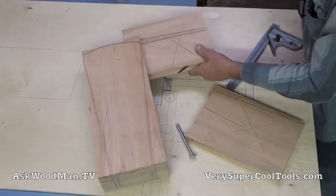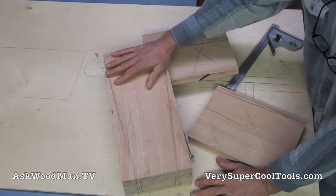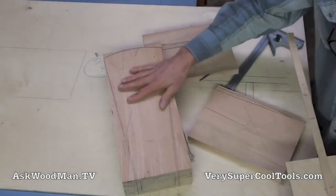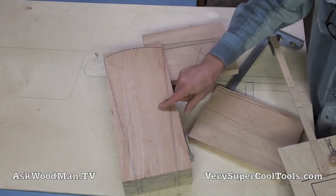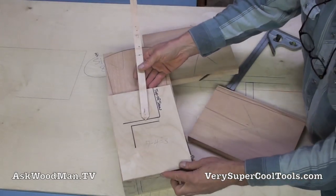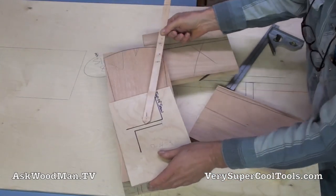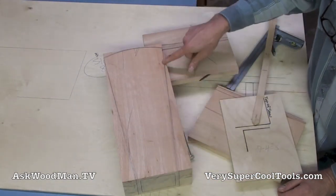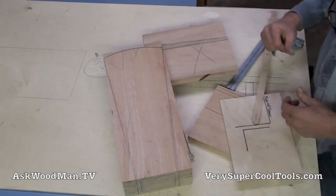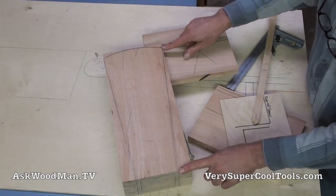Let me also discuss how I did this while I've got it right here. I drew my keystone — the keystone ended up being just ever so slightly different than the drawing. I didn't want to put a nail in the face of my piece. On the four outside pieces in this batch of beech, there was one quarter-sawn piece, so I pulled that and made my four outsides out of it, which is really pretty. I just took a piece of scrap, ripped it down to the width I wanted, clamped this on, and used my pencil to scribe my line. This is exactly five degrees — I wanted to stick with that dimension for the tables and other things I'm going to make later so everything is this five-degree dimension.